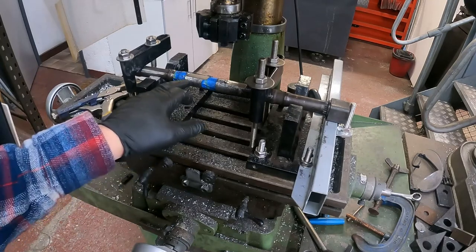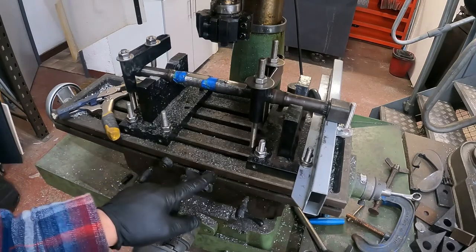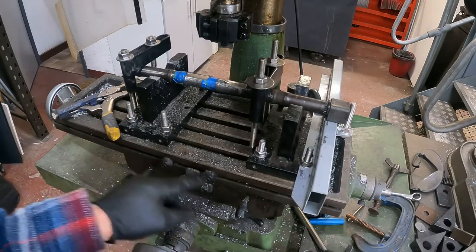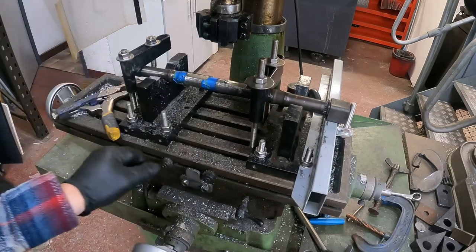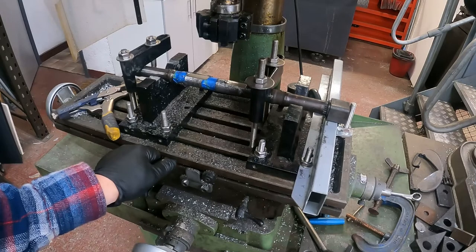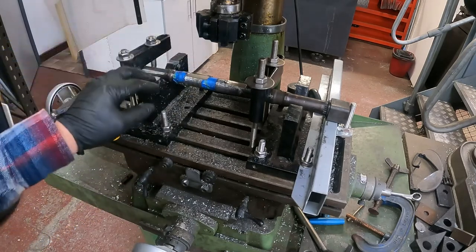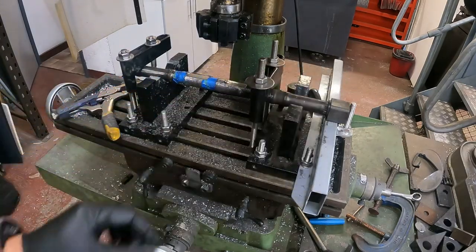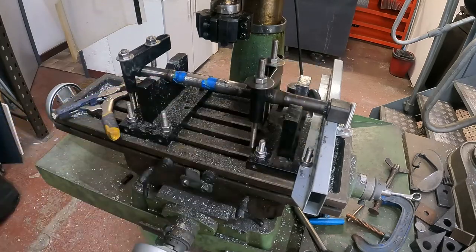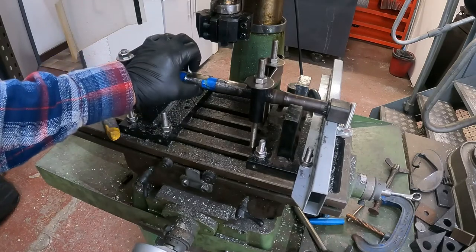I'm milling a flat between these two pieces of blue tape. It's stopped on these two bed stops here, so it can only go a certain distance that way and that way. But I flip it over to do an opposing side. I've still got the block welded on there, the square tube, which allows me to be specific on the rotation. So yeah, seems to work.